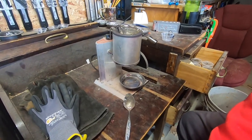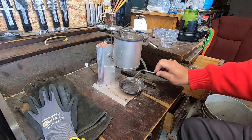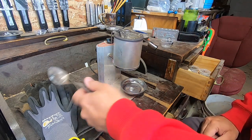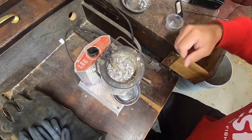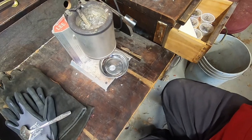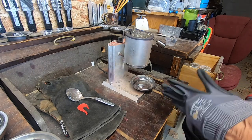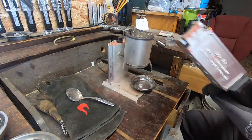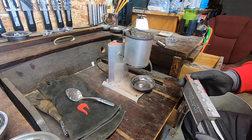When you're first initially heating up your lead, sometimes you'll get a drip off the spout here — actually sometimes it'll be a drizzle — so I like to put something underneath to catch that. When I first start, I always turn it up to about number 10 on the dial, and then once I get my lead to where I want it, I'll kick it down to number 4 or 5. That works pretty good for anything under 3 ounces. You want to preheat your molds, and some guys like to put a candle to their molds and smoke them, but some molds you kind of need to do that to get the lead to flow into all the nooks and crannies.